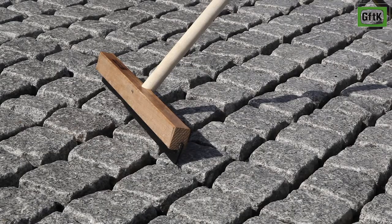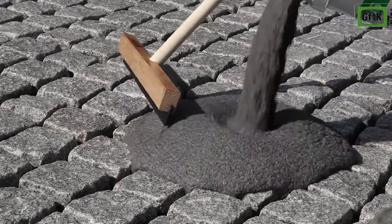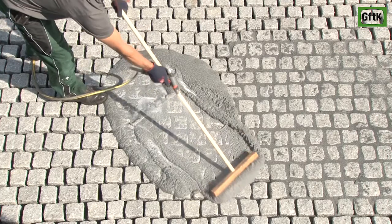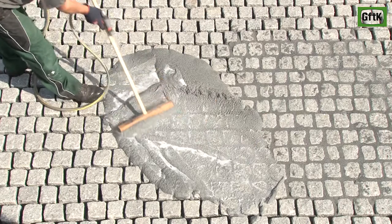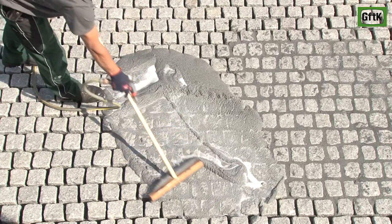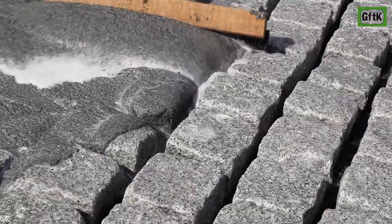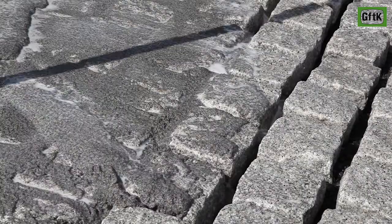After thorough mixing until smooth and homogeneous, the mortar is instantly poured onto the pre-wetted surface and into the open joints. The mortar is now thoroughly worked into the joints using a rubber squeegee, ideally in a diagonal direction where it self-compacts. By spraying water, the flowability of the mortar will be improved. We recommend filling the joints from the highest to the lowest points.